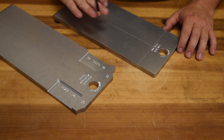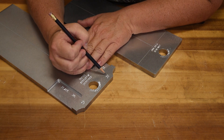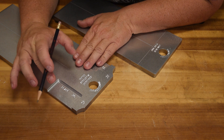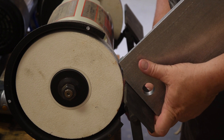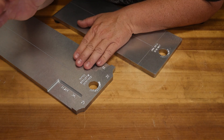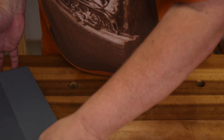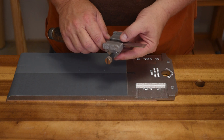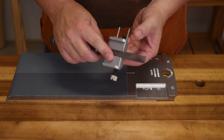In the production run, both the standard and the deluxe versions will have cut-outs on the upper corners set to 25 and 30 degrees. These help you consistently set up your grinder — simply place the top of it onto your ledge, touch the bottom edge down to your grinding wheel, rotate it until the top edge touches, and lock it down, and you will have your grinder set up. For those of you who prefer using jigs for your sharpening process — and I am one of those people most of the time, because it only takes a few seconds to set up — we have recesses set up for the ever-popular Eclipse knock-off style jigs.